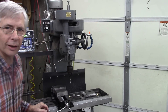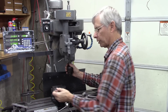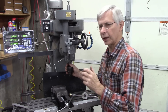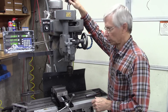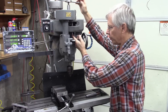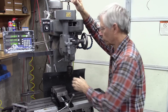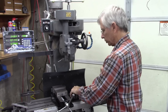Then at some point I've got to raise it back up. Sometimes depending on the drill size you can find a collet that fits it, but most often the drill size you need the collet won't work on. At least my collets won't. ER collets work a little better for a variety of sizes — the sizes overlap — but if you've got R8 or Brown and Sharp number nine like I've got, the sizes don't overlap. So I've got a solution.